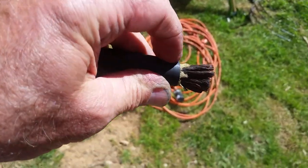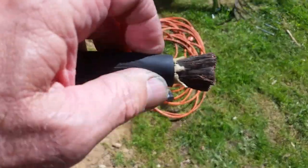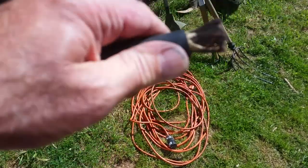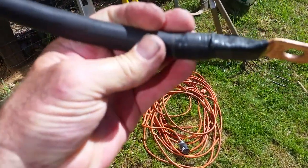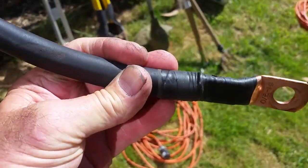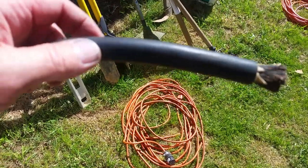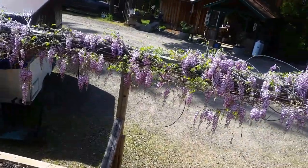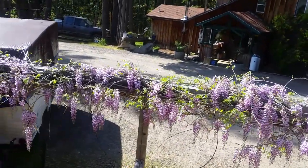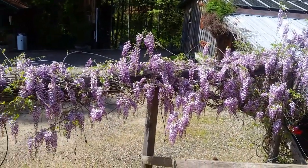I brushed these out with a stainless steel brush and got as much oxidation out as I could. But all it would have taken is one crimp with a little more oxidation than the other and a little more resistance than the next interconnect cable, and I've got a problem. You don't see the problem right away — you'll see it four years down the road. So I wish I had done this earlier, but it's a hundred and twenty bucks to change the cabling out.